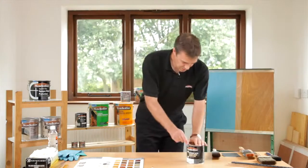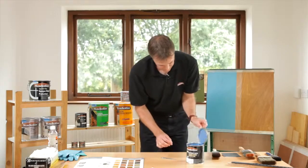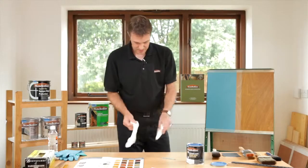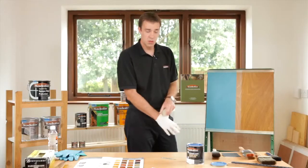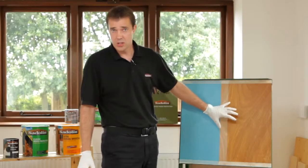So it's probably a good time to have a look and see how this applies. Opening up a can — this is a nice bright colour called Shaman. You can see on the board behind me we also have Lapis Lazuli, which is the Ultra system. This demonstrates the two types of look you can get: you'll use an opaque system if you want a solid colour, and if you want to show off the timber then you need a highly translucent system.